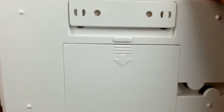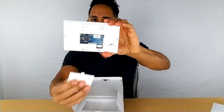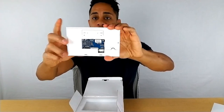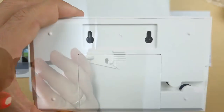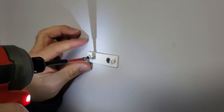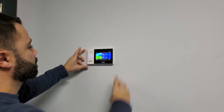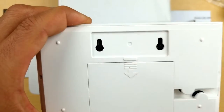And your voice message that you've programmed in there. When you turn it around, you see two covers — one is the main cover which you just slide down, and above that is what's called a built-in tamper switch. When the internal power is on, this must be on or the alarm will sound. The tamper switch is screwed onto the wall and then you place the OSI alarm panel onto it until it clicks. If someone tries to rip it off, the circuit is broken and the alarm sounds.